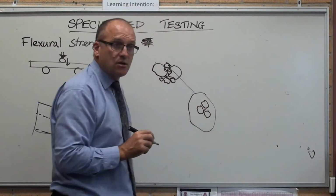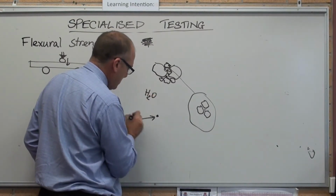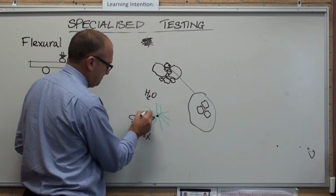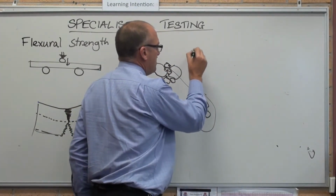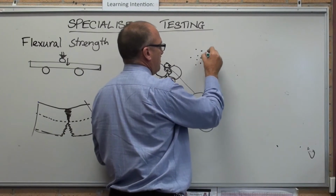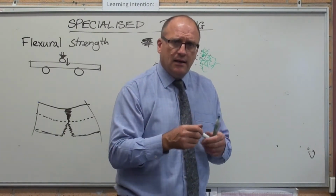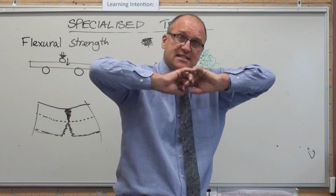In there is cement. What's actually happening when you add water plus cement, it grows out tendrils. It physically grows out plates, like so. If I've got multiple pieces of cement, multiple grains, for want of a better description, of cement, particles, multiple particles of cement, all those fibres and tendrils lock into each other, and that's physically what makes cement set hard. When you add water, the reaction product grows outwards from the cement particle as tendrils or as plates that grow into each other, coalesce and interlock firmly.